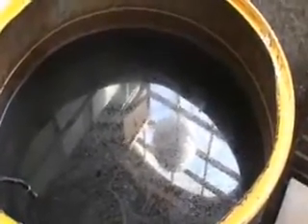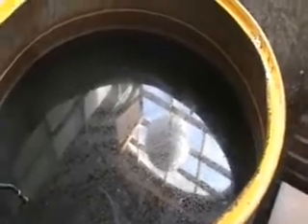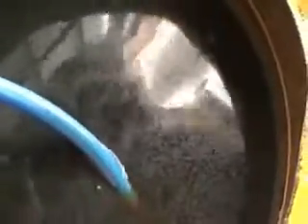That's the raw grease straight from the restaurant. I like to heat it — I put a couple heaters in there and they'll go for a good 24 hours or so. I like to get it up to a sustained heat of 180°F for at least a good six hours to dewater, knowing that there isn't any residual water. I like to suck off the top of the dumpsters, so I'm just going to put a hose into it and we'll suck it up into the first barrel.